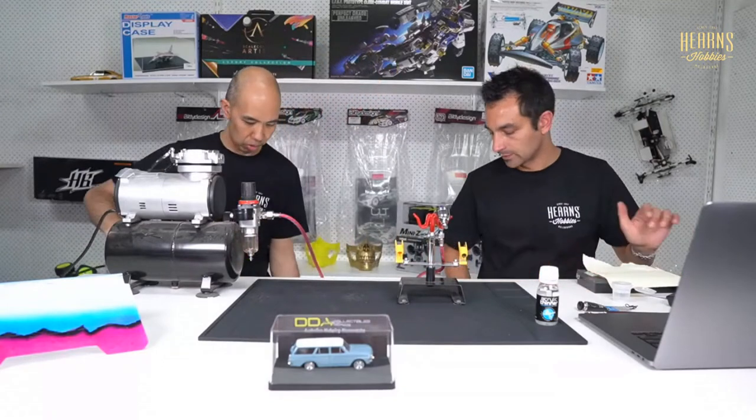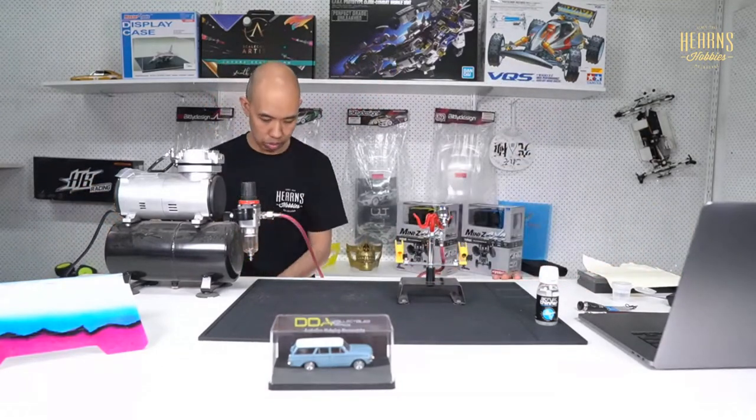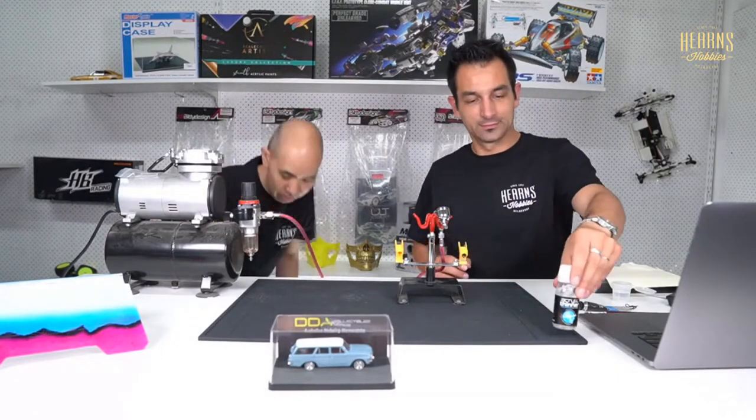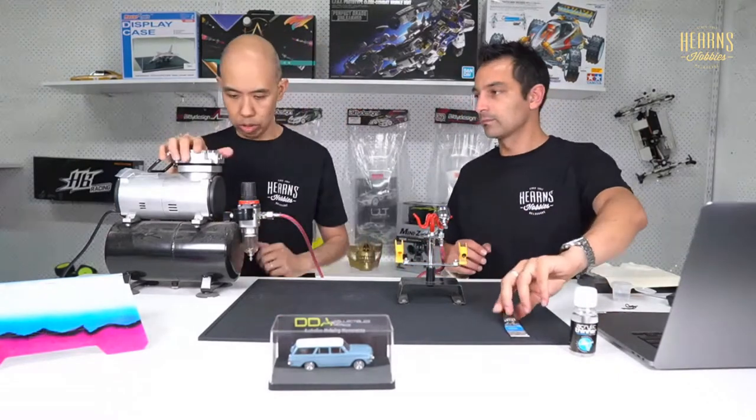All right, other thing you need to do is you need to plug it in. That's important, no power. Yeah, no pressure. No power, no play. Okay, so on the bottom of these tank type ones, they've got a breather valve, which you normally leave loose so all the moisture inside the tank can escape. If you don't do this every time, then it'll all rust up. So make sure that's tightened up. That's tight. And I'll switch it on. A bit noisy. Off it goes. Not too noisy.